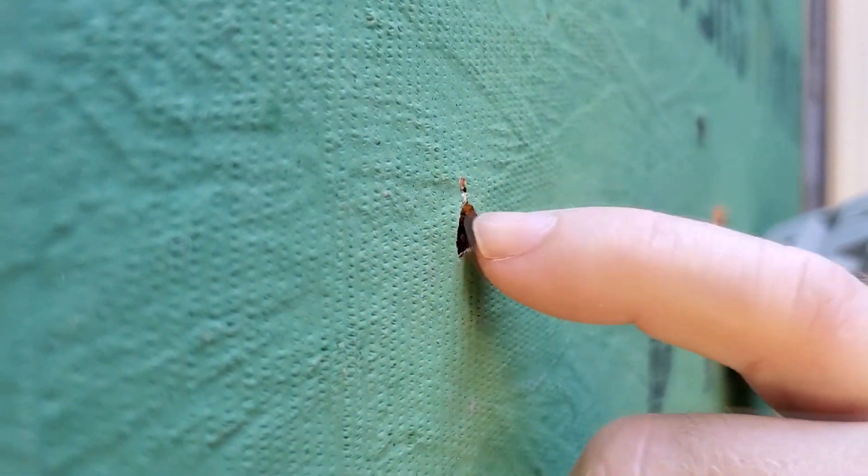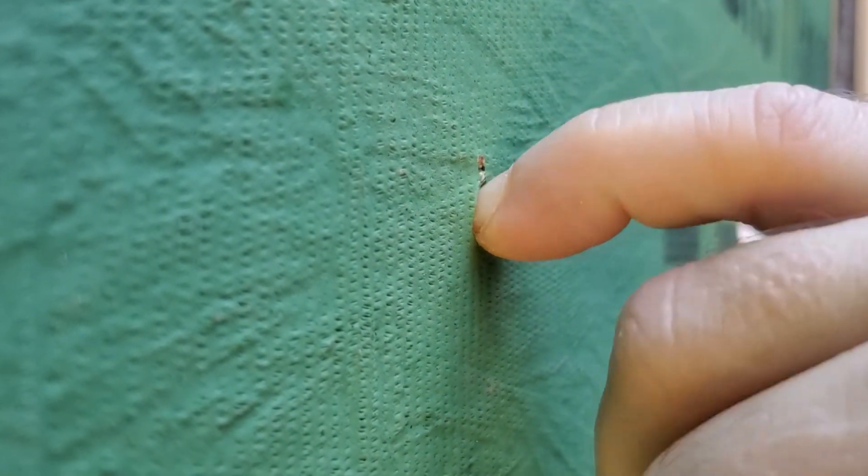Let's talk about some of the things that I saw in this particular inspection. One of the things we noticed is that a few of the nails are overdriven. You want to make sure that these are sealed up properly, but also put another fastener right next to it. Also notice that some of the sheathing did not cover the bottom plate all the way, so we want to make sure that gets sealed up. The tape only works well if it has proper coverage all the way across.